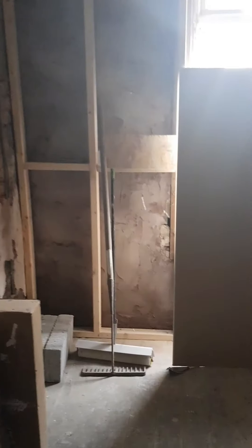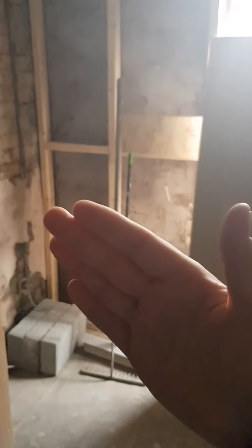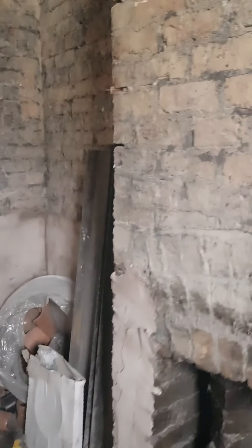The bedroom door is here. Same again, this was an open plan bedroom originally — we put its own corridor in. We've gone and tanked all the outside wall because it was damp. We've gone and studded that off. There'll be insulation-backed plasterboard.